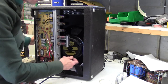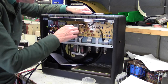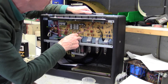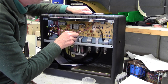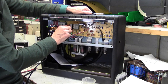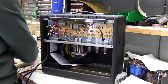They can't take it. Whilst I'm here, I'm going to plug the speaker in, and that handy dot reminded me where the speaker went. Right, there are two greens here which are kind of hanging off, so I'm going to push those on firmly. Memory, I just connected a brown and a red. So here's the brown, handily marked brown, that's one side of the output transformer. And here's red, handily marked red, and there's the other side of the output transformer, or the centre tap of the output transformer, actually. Good, that is actually finished now.